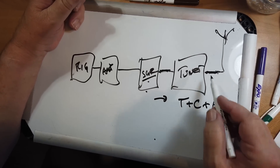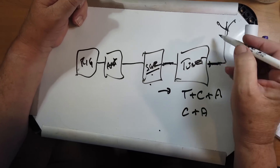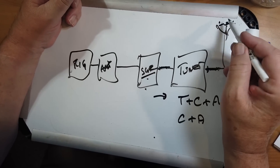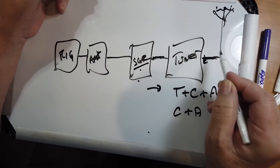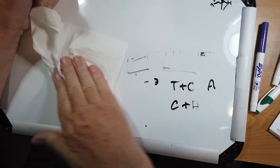If you put the meter before the tuner, you're just looking at the coax plus the antenna. Now, if this is 50 ohms — if you've got the system tuned as close as you can get to 50 ohms — it's going to look like 50 ohms down at the shack. To know what condition the LMR cable is in, is it necessary to disconnect it and leave it open or apply a 50-ohm load? Apply a 50-ohm load.